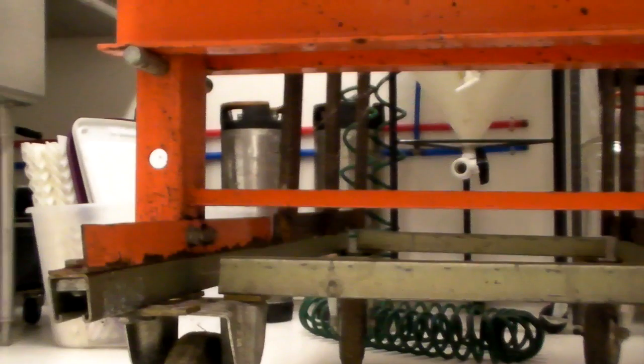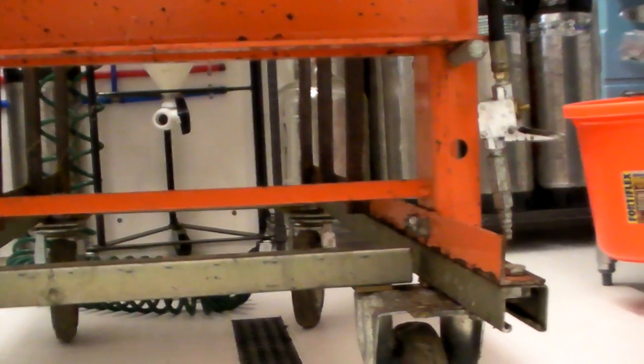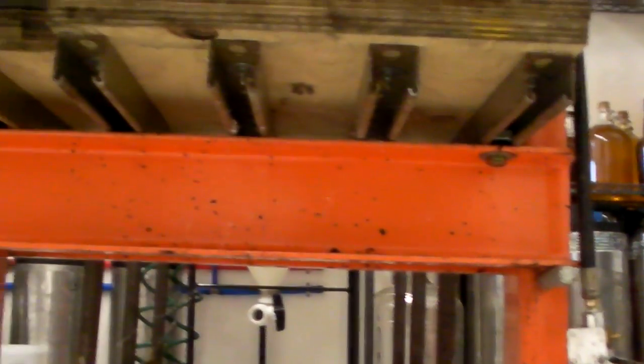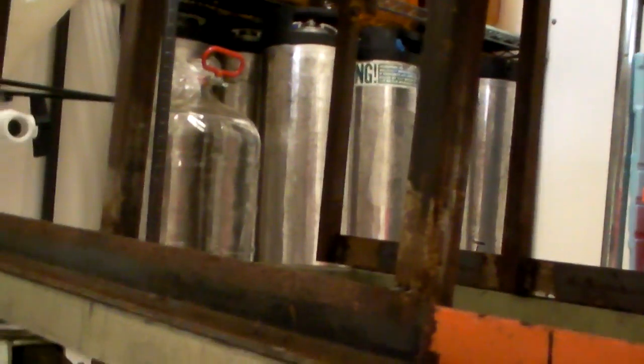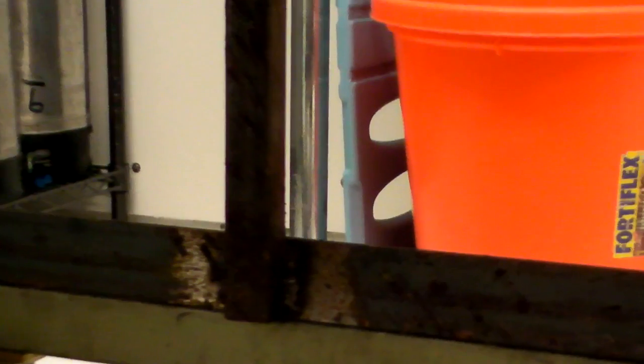The frame itself is bolted onto the base that is also made of strut, bolted to a wheel set that I got from Harbor Freight. In back, I took angle and square stock tubing and I welded them together. You can see that's welded and then that's in turn welded to the angle — so that's very solidly attached. Underneath, elbow material welded in place to support the backside.